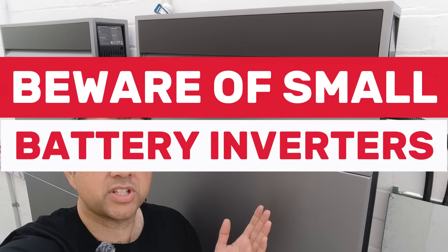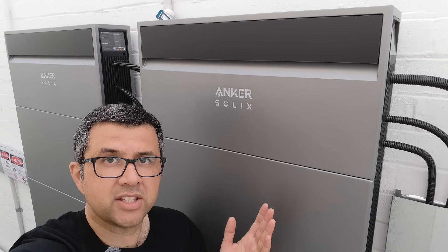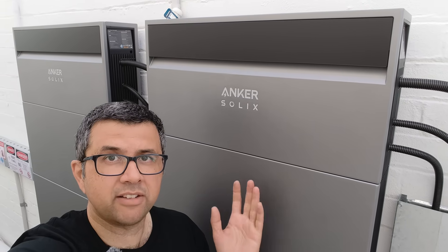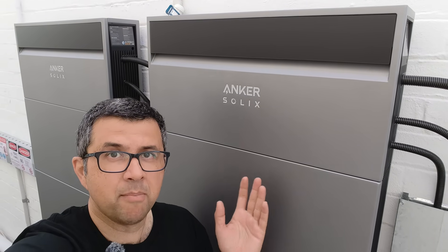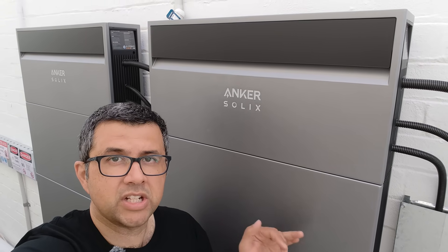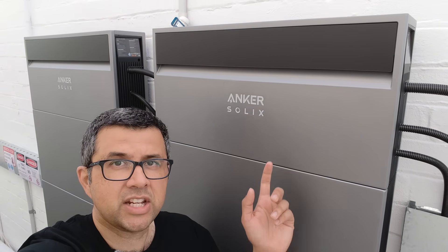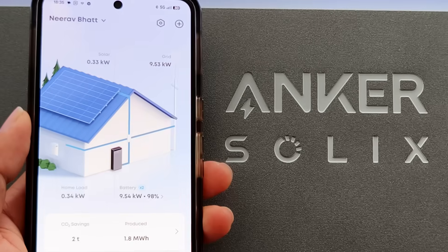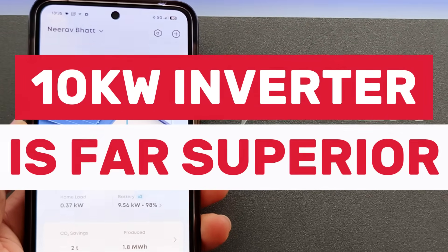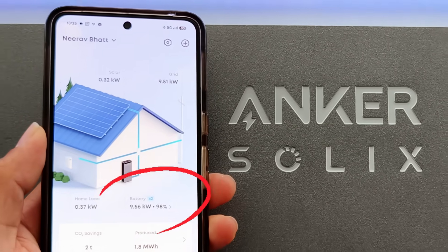Australians have gotten super excited about the cheaper home battery scheme, and a lot of them have been sucked into offers for really massive battery systems like 40 or 50 kilowatt hours. But there's a trap with those battery systems — I explain it in a separate video in more detail, link in the description. The short form version is: the catch is the inverter. They only usually have a 5 kilowatt inverter for these cheapskate battery systems, and that means your battery system will be underpowered.